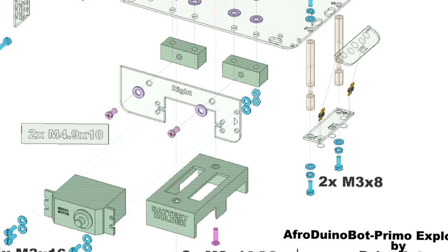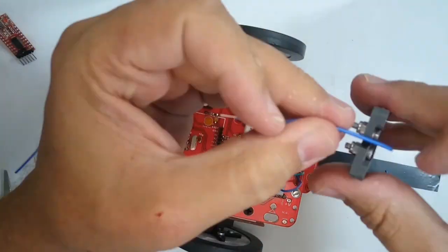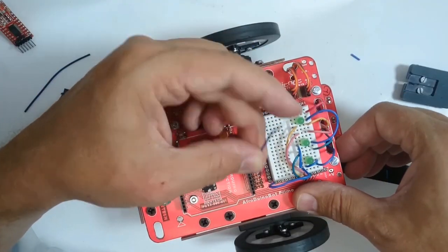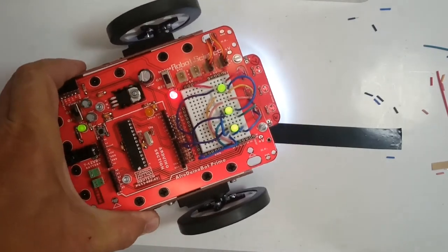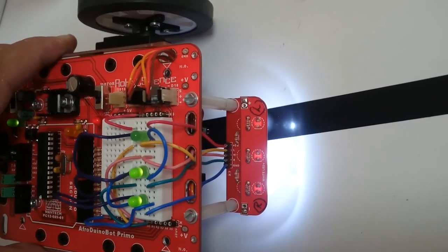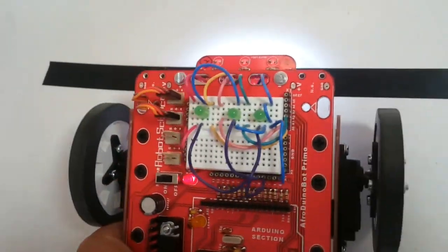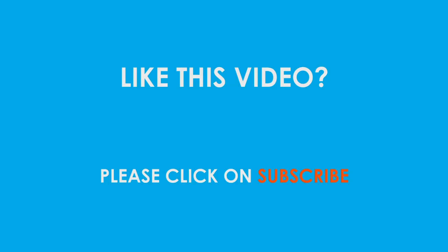If the module is up too high it becomes more susceptible to interference from ambient light. Another useful way of monitoring the line following module is to place three LEDs on the breadboard and upload the program in datasheet 6.07, which will switch an LED on when its corresponding phototransistor is over the white maze surface and off when over the black line. We would like to thank you for watching this video — please click the red subscribe button if you would like to watch more of our exciting robotics videos.